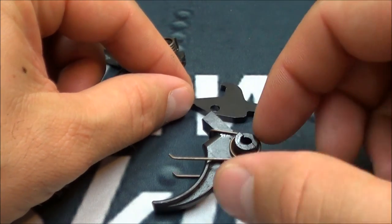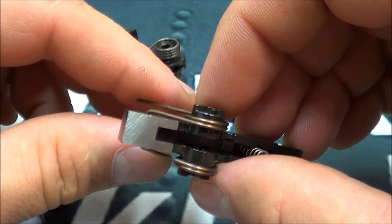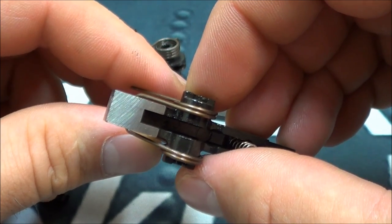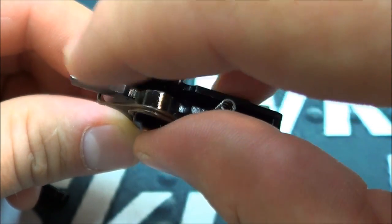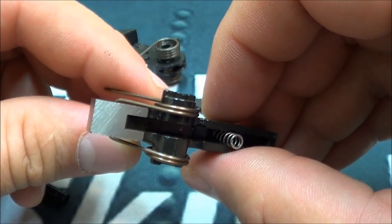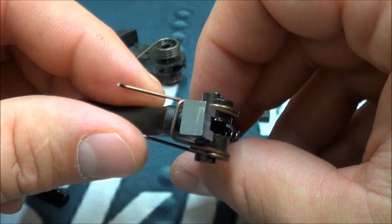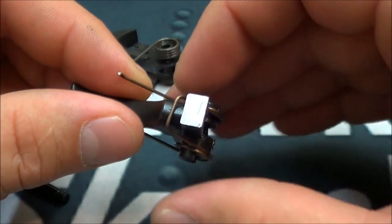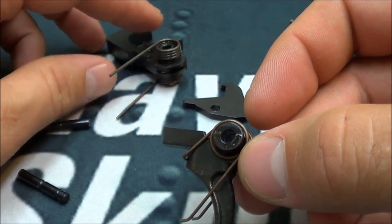Now when I say sand, we're going to use sandpaper, yes, but what we're really going to do — on these machined faces it's definitely not smooth for all intents and purposes. That's what we're going to be working on. You can see the light refracting off a little bit there. What we want to do is just get rid of any of the little striations on there. The goal is to smooth, but not remove material, because when we start removing material is when you're going to start getting yourself in trouble.